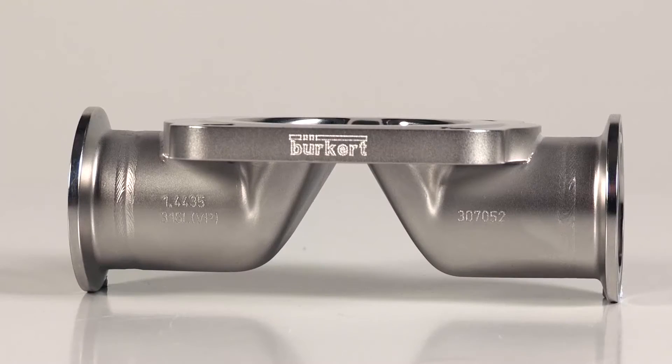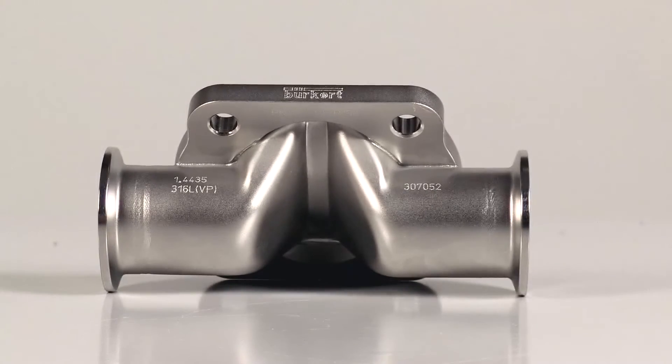The bulb is then cut and rolled so that the material is now flush with the supporting diaphragm. The tube is then laser welded to the flange, both on the bottom and the top. It is important to note that no material is added at this point.